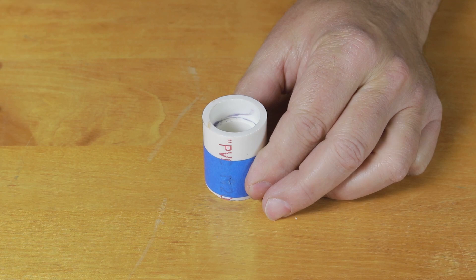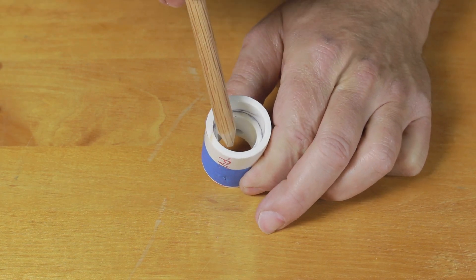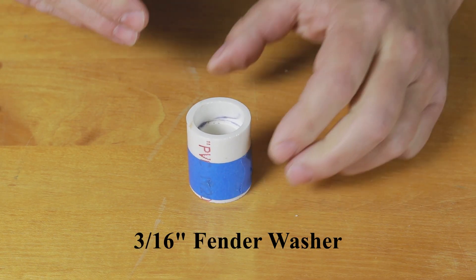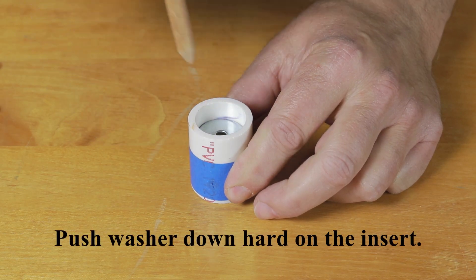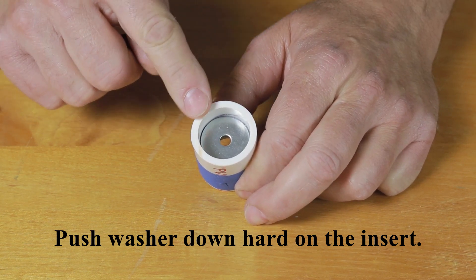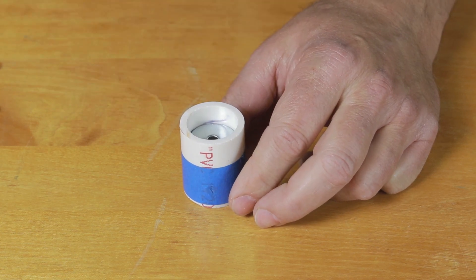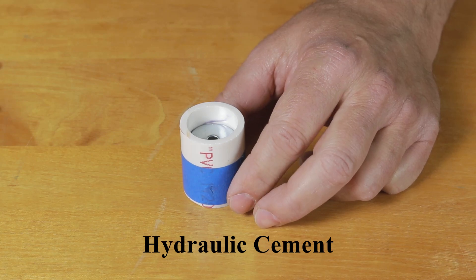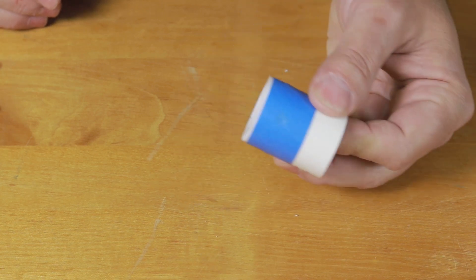Place the nozzle on the casting base and then fill it up with concrete until you get just above where the insert is. Then place your washer — in this case I'm using a 3/16 fender washer. In another video later, I'll be using a quarter inch for a different size motor. Drop that in there and then continue to fill it up with concrete until it's even with the top. After it sets for a certain amount of time — and that depends on the concrete that you're using; I use Quikrete hydraulic cement — then you'll want to remove it from the base and check the bottom of it.